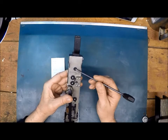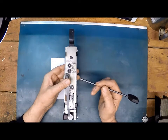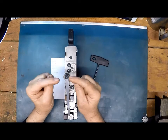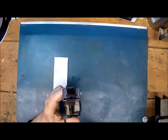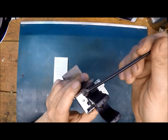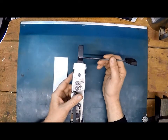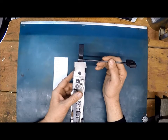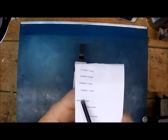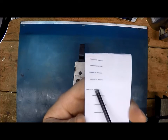Basically, we're going to go over this adjustment. When you loosen this and move the faceplate up and down, that makes your staple legs longer or shorter. Then there's an adjustment up here — this screw right here and this lock. When you unlock this and adjust the screw, you're allowing this casting to be higher or lower, which essentially will adjust the left leg independently, making it longer or shorter so that it matches the right leg.